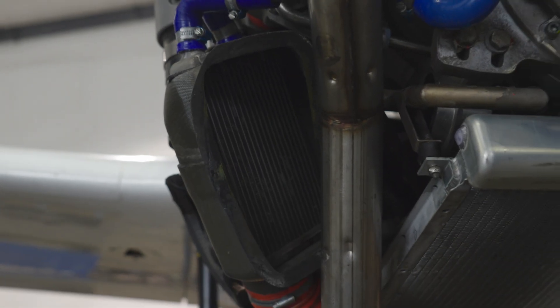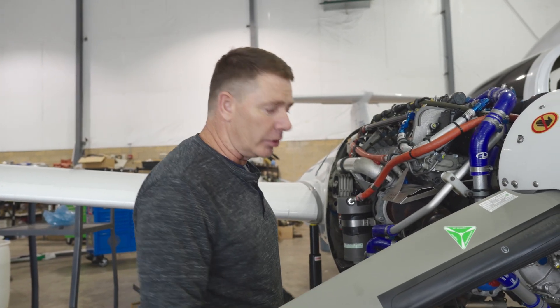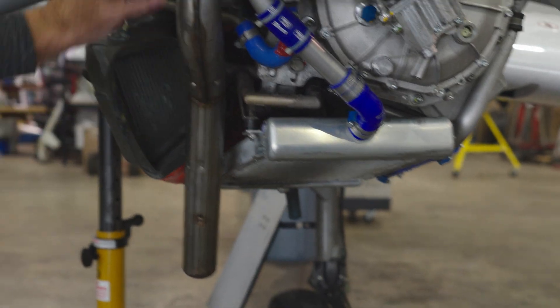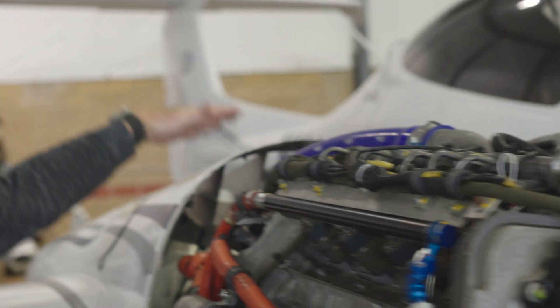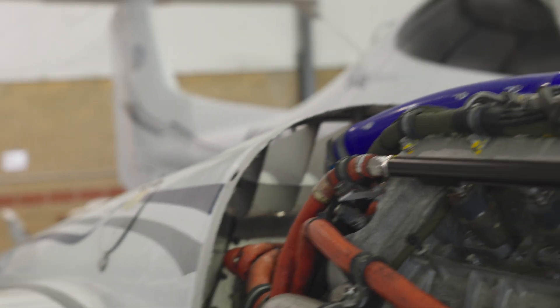The right engine environmental is the defrost. Unlike most airplanes, this cooling system is liquid cooled, air cooled, and oil cooled. We use ram air in the lower cowling — high pressure air comes in through the lower cowling, goes through engine cooling, through all your coolers in the back, and comes out the vent as low pressure. High pressure in and low pressure out — that's how we get our cooling efficiency.